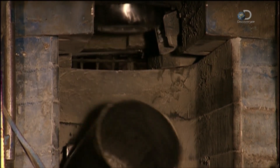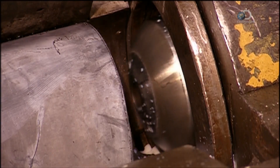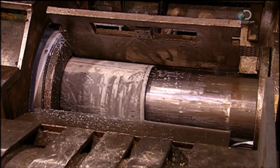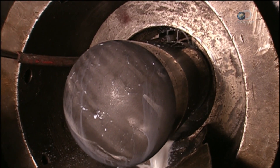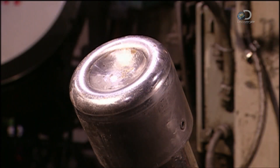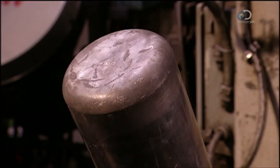After the disc comes through, steel jaws clamp down on the mandrel and the cylinder slips off. Now another press stretches it even more, applying 250 tons of force to continue forming the walls of the cylinder. That liquid is a coolant to prevent overheating. The cylinder goes through as many as three presses, each one stretching it another 60%. This press forms the closed bottom end into a concave shape that reinforces the base.